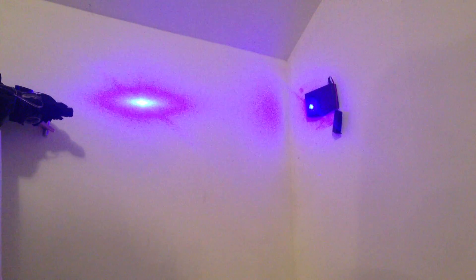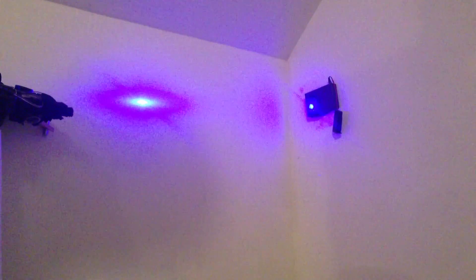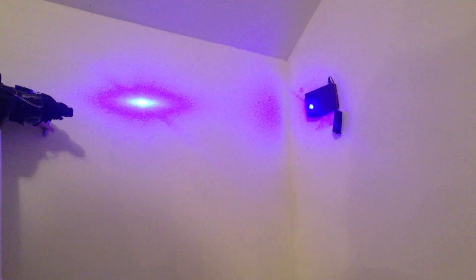It's only around 5 feet apart here, but the good thing about this is it can cover very large distances. So as soon as I break the laser beam, the light stops shining on the solar panel and the Arduino reads that and triggers the speaker.